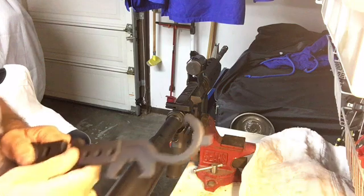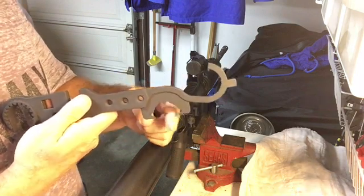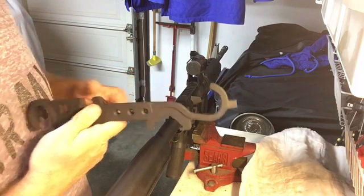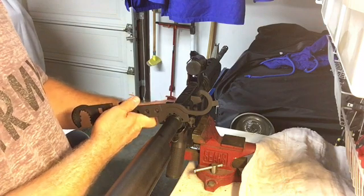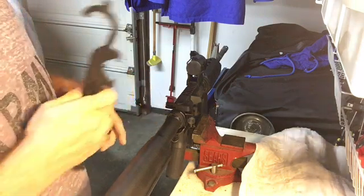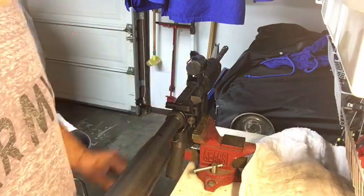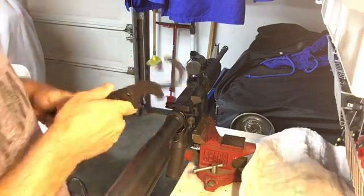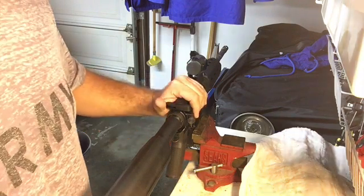If you have your tool — mine actually has two places that fit my castle nut — I used this area here because it has three little protruding pins that lock into the grooves on the castle nut. I have my rifle mounted on a vise with a magazine block. You put the tool on and crank down to loosen the castle nut. It was a little nerve-wracking — the gun started to twist and I didn't want to crack anything on the lower, so I held it and gave it support. I had to break it loose where the stake is, and it did come loose after applying some good pressure — it finally popped loose.